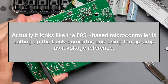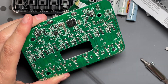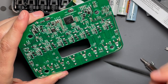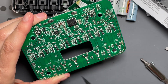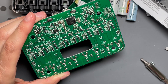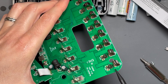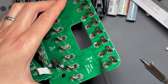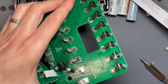There's individual switching for each of the bays — you can see groupings of four, one through eight, one for each channel. Down at the bottom, there does seem to be some resistance between each of the negative terminals for the AA and AAA cell, so they are separated from each other. That allows it to detect whether a AAA cell is in there and modulate the current accordingly. This is a nice thing to see, because back when I reviewed the Power Owl, both AA and AAA were sharing one metal loop and receiving 2.2 amps — not great for AAA batteries.